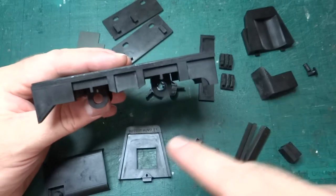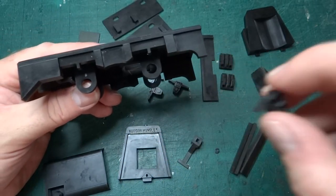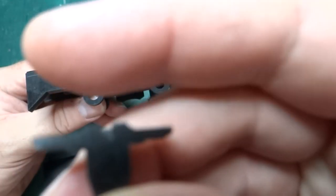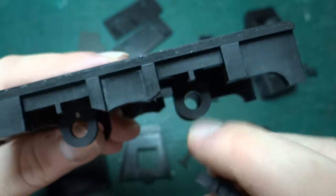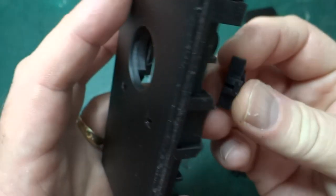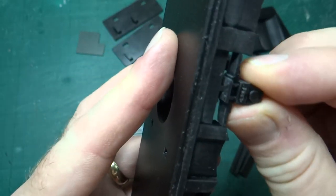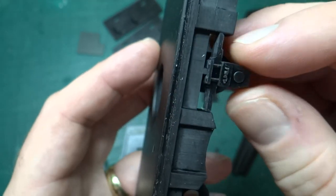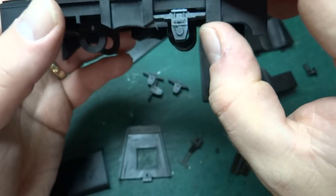Once you've got the wheels in, and the axles are the right length, you can then fit the axle boxes. These have this little notch in the back. The notch fits on these pins. Again, you might need to file slightly, but the notch should fit nicely on the pin. What you're looking for is to make sure the leaf springs are nice and horizontal.